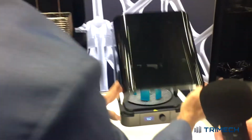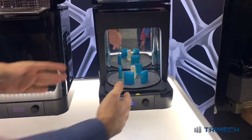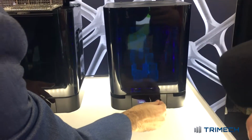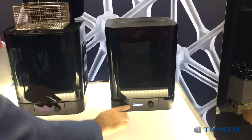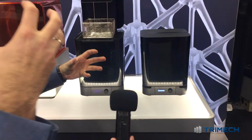And we also have this UV chamber, which is pretty nice, not only because of the UV light, it turns and rotates, but also you can control the temperature, which is super important, up to 80 degrees. So you really can influence those monomer chains inside.